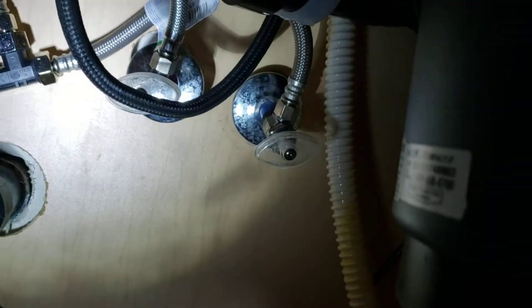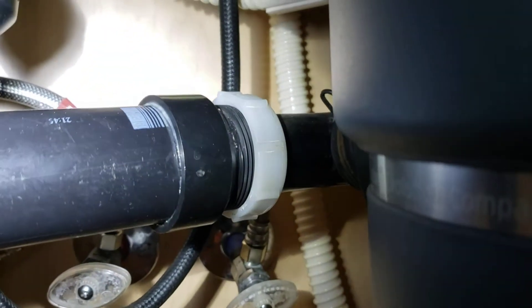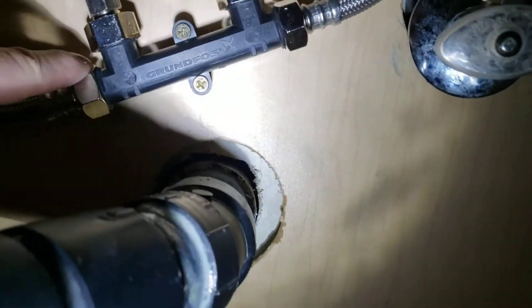It's really tight to get to out here in the kitchen. The faucet mounting hardware is corroding in place, so you may have some water leaking down here. Same thing here — hot and cold supply lines. You can see these pipes are just hanging in the wall; when they stubbed them out it's plastic tubing stubbed up with a shutoff. We didn't replace the valves but we gave you new supply lines. On the hot side we left the existing line in place — the one with the brown tag that says MilFlex — since we just needed it to reach our connector.